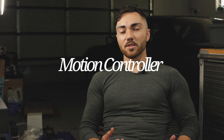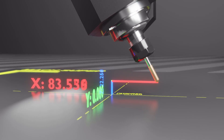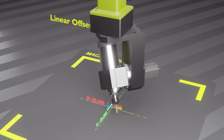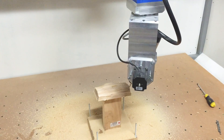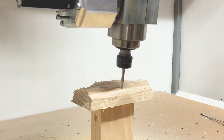The CNC controller. I used Mach 4 with a Warp 9 Ethernet SmoothStepper and didn't have a great experience. Mach 4 is not a great choice for a five-axis machine because it doesn't have the inverse kinematics to handle tool center point rotation — where as the tool rotates, you need to offset the linear axes to keep the tool end on the programmed path. Also, when working with Mach 4 and the Ethernet SmoothStepper, I got a lot of bugs. When I used the inverse time feed rate, it kind of just forgot the path it was supposed to take, went off in a random direction, and ruined the workpiece. So my experience running a five-axis DIY machine with Mach 4 and Ethernet SmoothStepper was not fantastic.